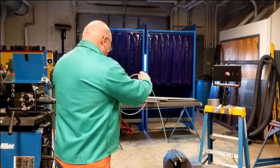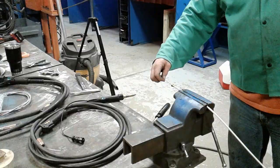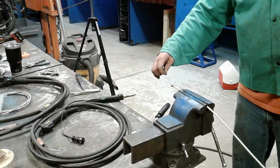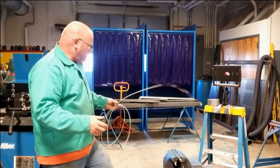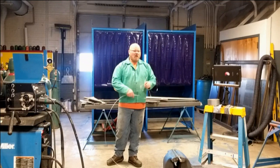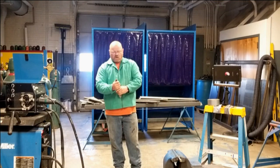If I add a second coil — representing your gun looped up on the floor in the booth — it is now almost impossible to push even from within a few inches. Pushing any harder just bends the wire. The key takeaway is: in order to extend the life of your liner and reduce feeding problems in general, keep your gun straight. Don't coil it up into a small ball on the floor. Keep large loops, and keep any loops you have to a minimum. If you have to have the gun looped, recognize that you're probably going to have some feeding problems.